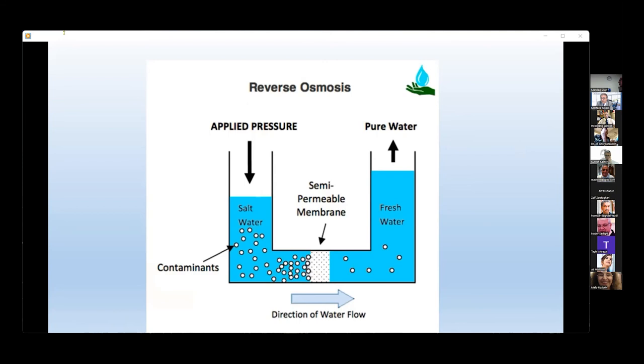An important point has to be taken into account: this system is due to high power consumption and very costly water purification filters. This is very expensive to run, and subsequently the cost of water to the consumer will be high. Another noteworthy point that we have to take into account: if we consider the newest and more advanced and efficient reverse osmosis seawater purification, unfortunately, it has the following weak point like the older type. Water enters the system for purification, 80% of that water will be purified, the remaining 20% is impregnated with 80% of the salt taken from the seawater, which usually returns to the sea. A high concentration of salt returns with 20% of the water and will pollute the marine environment with more salt.